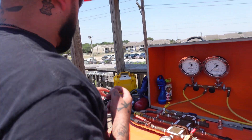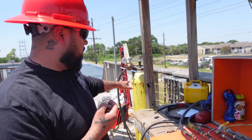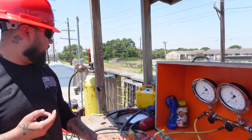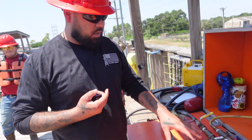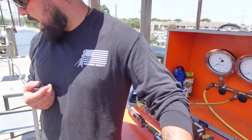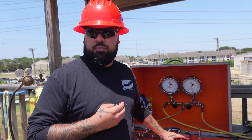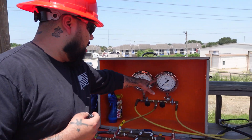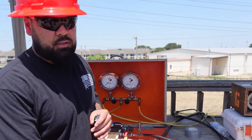From what we were taught here: we've got our supply back that way with those valves, compressors already drained, filters are ready to go. Everything is open up to this manifold — that's got your main air, your standby, your HP air — which goes down to their pneumo. Right now we've got just under 150 in the regulator. Valves are closed going straight to the hats via umbilicals until the diver is ready. Once the harness is set up, we'll open these valves and make sure they've got air from the rack. The rack operator's main responsibility is to monitor all these gauges, make sure there are no leaks, and make sure they have air. If there's a leak, we've got to find it. We're sending in a standby diver in case of emergencies, and we're cutting the air off purposely today.